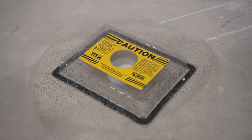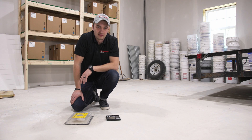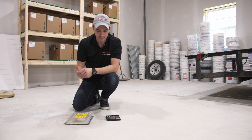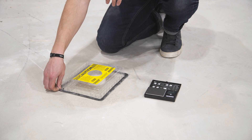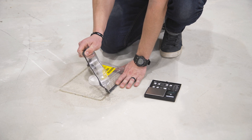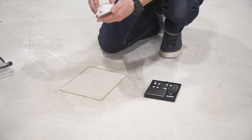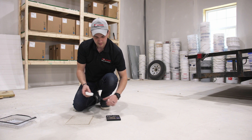We placed an additional test at the other side of this garage a few days ago to show how to collect the reading. To remove the dome, you can either cut the top with a razor knife to reach in and grab the dish, or carefully pull up around the test — just make absolutely sure you don't bump the dish or spill any calcium chloride, as that will throw off the reading. Once it's off, cap the dish before measuring.